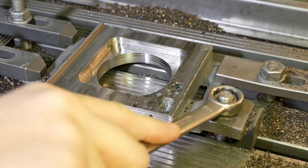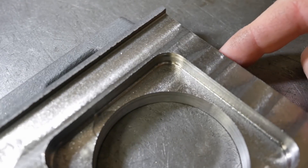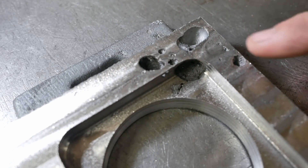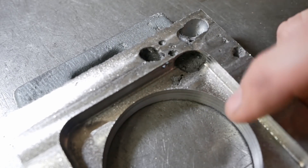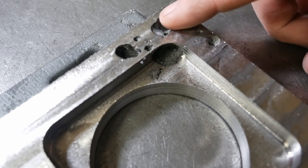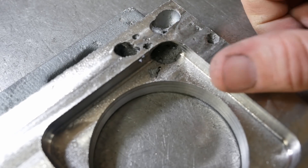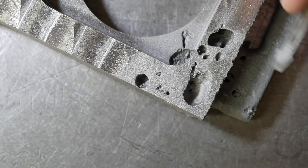There's the rough machining finished. Let's take it out and have a bit closer look at the shop of horrors. That casting is looking fantastic — oh, you liar! Yeah, except for that corner. I think the iron worm got into it a little. It looks pretty ugly and I should probably just throw it out or melt it back down, but I'm kind of curious as to what it looks like when you put in the metal epoxy. So I think I'll do that and then do the fine machining afterwards and see whether it can rescue a bad casting or whether it's a waste of time. To make the epoxy stick, I've sandblasted the whole area, taken the remains of the slag out of it. This is the product I've decided to use. Don't know if it's good or not, but let's give it a go.